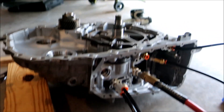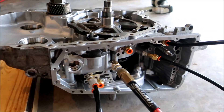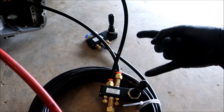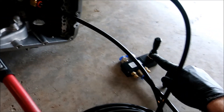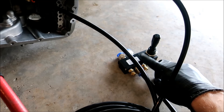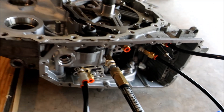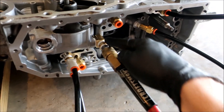Let me give you a little preview of what I've been doing. Apologies for the noise - everybody's cutting their grass today. Basically right here I have two pneumatic control valves. This one is going to be controlling the forward and reverse clutch, and this one is going to be controlling the variable diameter pulleys inside.